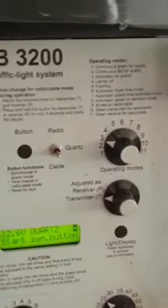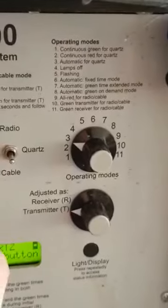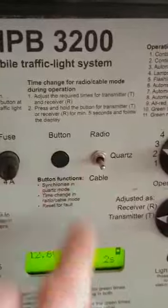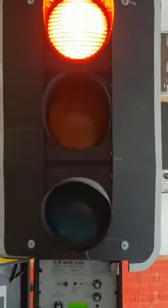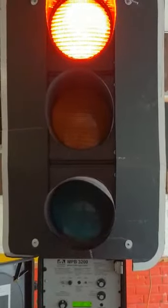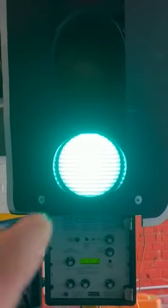What we do now is make sure that you're at the transmitter end — the other light should be a receiver. At the transmitter end we push the sync button. So we push that now — that's gone from a solid orange to a red, and then it will go back to green. This one is blinking orange.